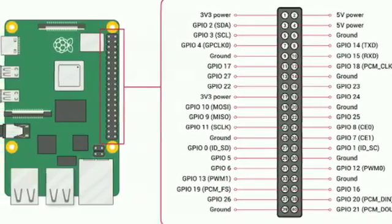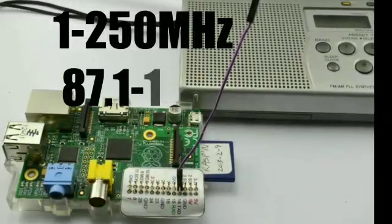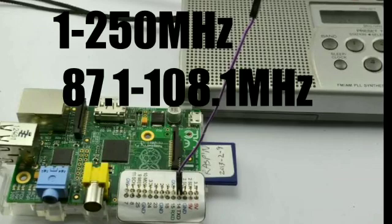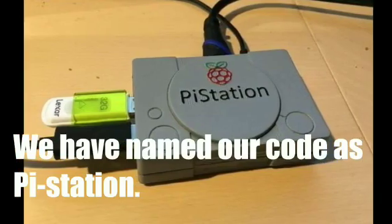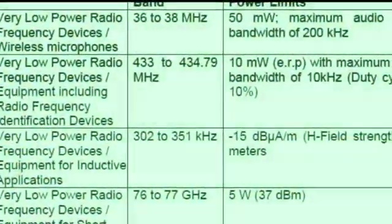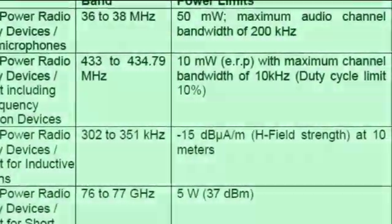The modulated signal will be given out through the GPIO pin 4 of the Raspberry Pi. We can simply attach a normal wire of 20 cm maximum to this pin to act as an antenna. The Raspberry Pi can handle anywhere from 1 MHz to 250 MHz, however it is limited in the code to 87.1 and 108.1 MHz, because generally radio bands do not go beyond these frequencies. The Pi station allows us to use the code in a more simple way, so all we need to do is simply load the music onto the Pi and play. However, since there was a chance of interfering with government bands, we were very careful in keeping our transmission within the unlicensed FM band to avoid interference with licensed broadcasters.